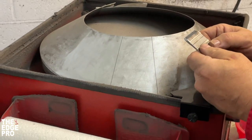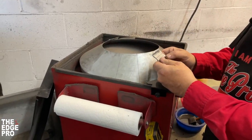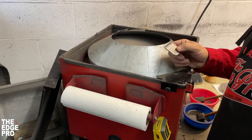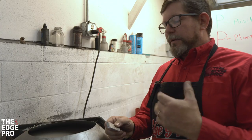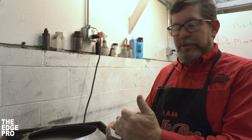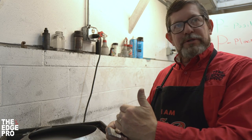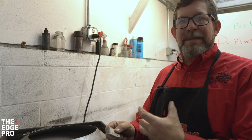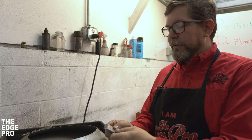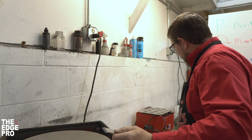The amount of hollow grind and how that crown is is very slight — just a few microns from flat to where we actually have that positive result. As it seats and we start at the tip where the metal is wearing and marrying to each other, it's going to start to flatten and really come in to where they match at least halfway to two-thirds of the way down the tooth.